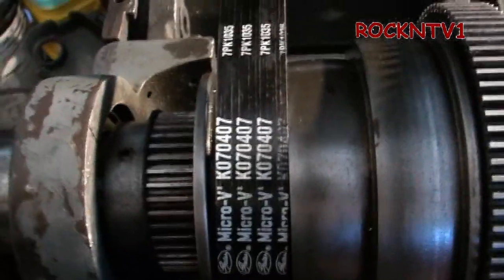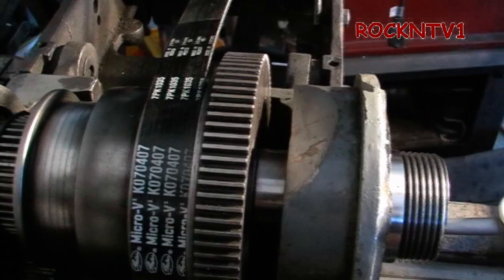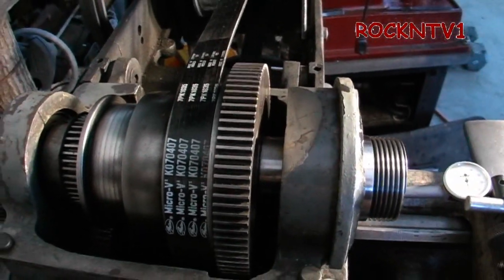Here is the part number on the belt that I used. And of course I'm not going to be able to show you what it looks like when it clamps down. But I did all the math I could possibly do. I used one of those sewing kit cloth measuring tapes to measure around the pulleys and come up with the number.